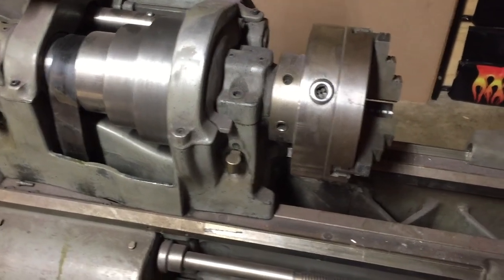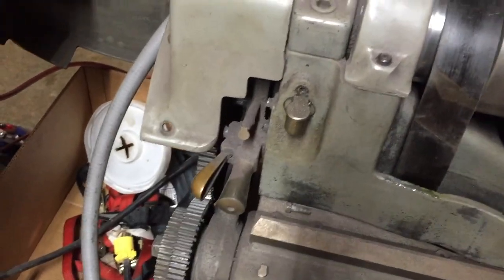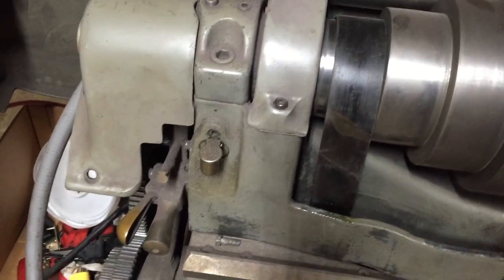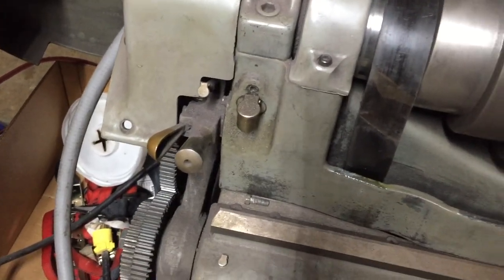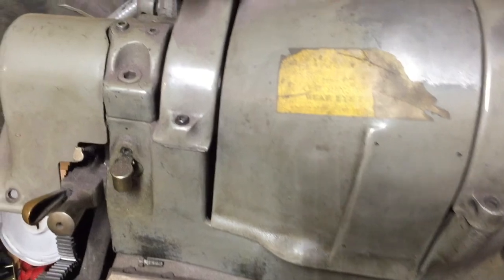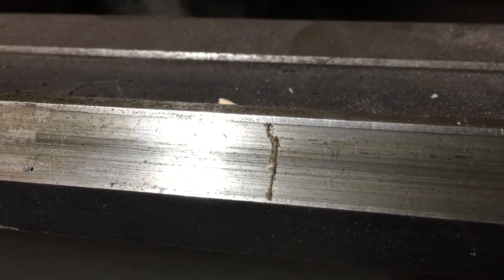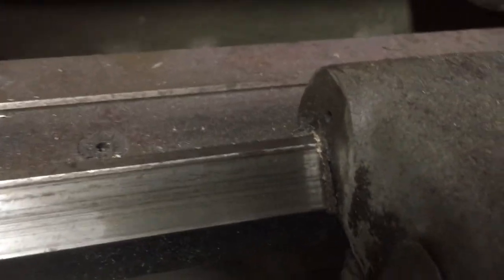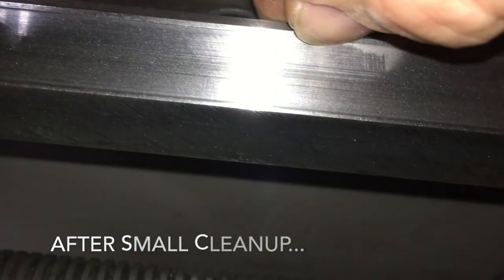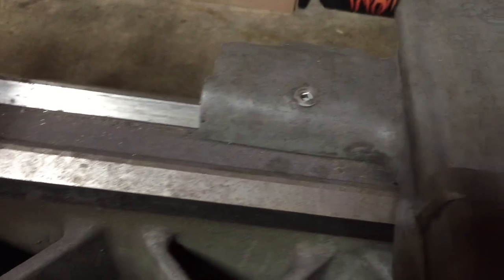At this moment I'm only able to visually inspect the machine. Everything seemed to work on it — the directional switch is switching and gears are turning. It does look and sound like it has seen better days though. It is missing a gearbox feed rate chart and some other plate, but it's nothing that couldn't be fixed or replaced. What concerns me more are the bed ways. When I was looking at the machine before I bought it I failed to pay close attention to the wear on the bed ways, and I think it's going to turn into a big project for me. The missing felt wiper probably contributed to this wear significantly, and there are also a couple of missing ball oilers which also didn't help.